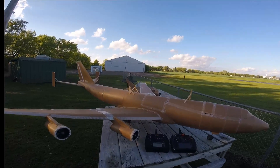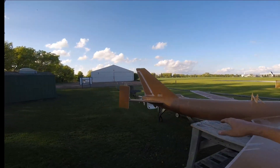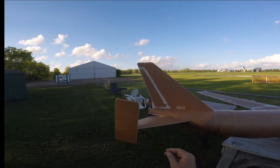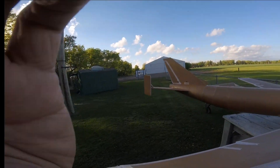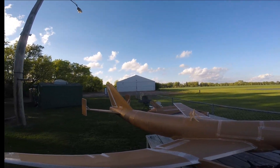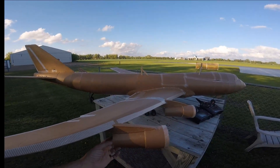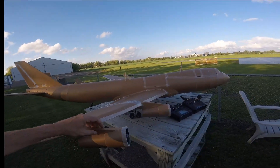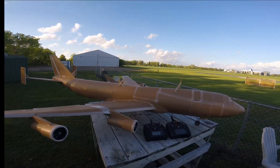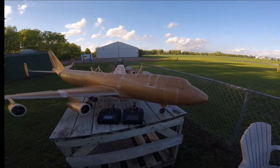Back to the 747 — I finished the covering, adding fronts and backs to the wing joining section, coated the back of the tail, and added the extra accessories that the real 747 shuttle carrier has to help with vertical stability while the space shuttle is blocking a lot of wind from the main tail. I also put new thrust tubes on here to get to the right thrust size, and covered up the wooden stabilizers, which helped rigid those up quite a bit.